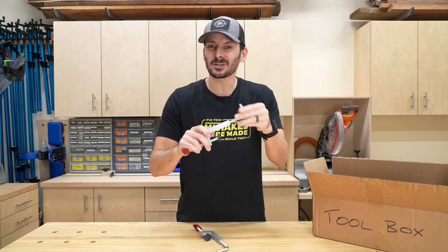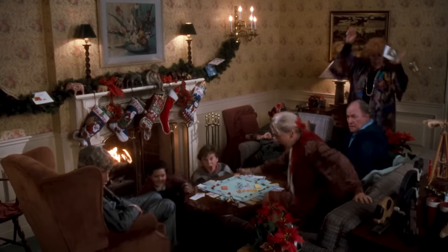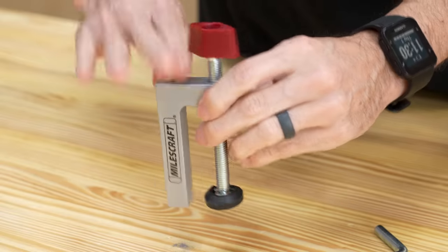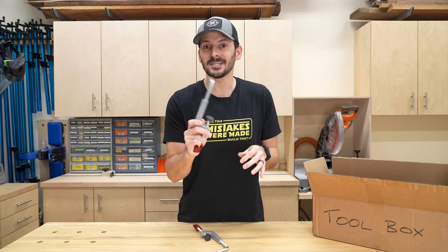When I first got these it was really hard to move and making a funny squeaky sound. I went ahead and spun the piece all the way out and there were a bunch of metal shavings in there from when it was machined — I emptied those out and now it works like a charm. No squeaking.